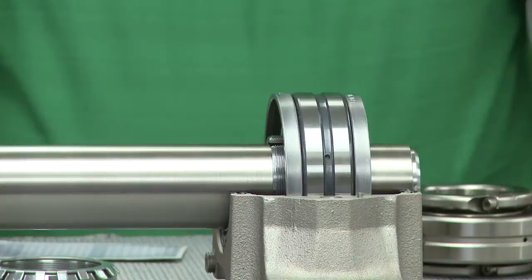No problem Tom. As we look at this application, we see that there are two housings and two bearings mounted on tapered adapter sleeves, along with two locating or stabilizing rings.